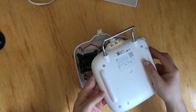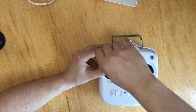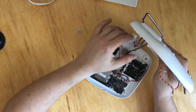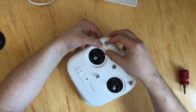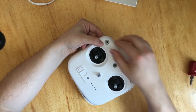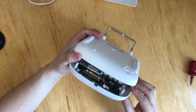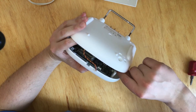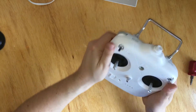I also glued them to one of the plastic tabs in the middle of the remote. Before putting the remote together, I took the S2 switch out and routed the antenna cables under the S2 cable so they'll never interfere with the tablet holder pin. Having the cables under the S2 switch keeps them to the right side of the remote. Now putting the remote together — connecting the gimbal cable, the charging cable, and the battery cable — then the screws go back into the back of the remote.